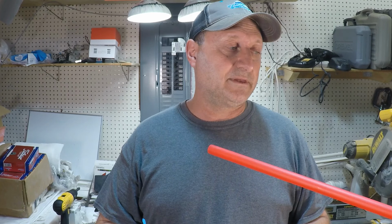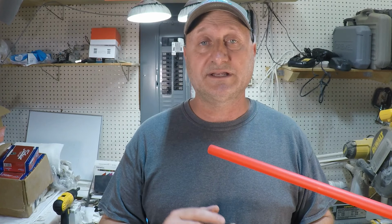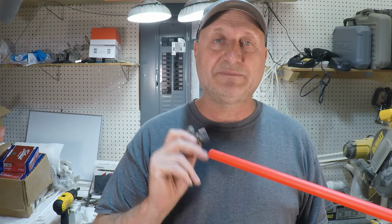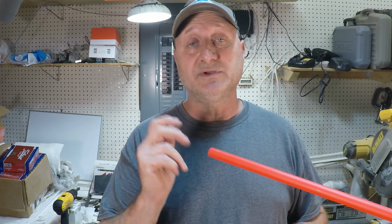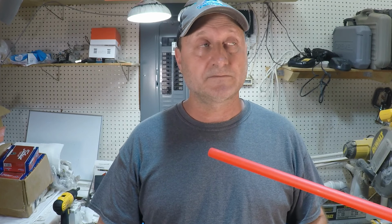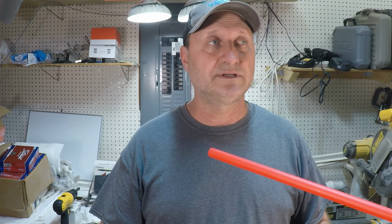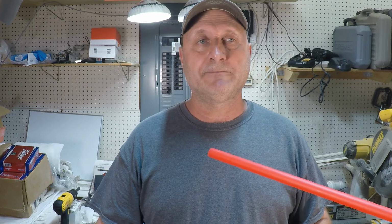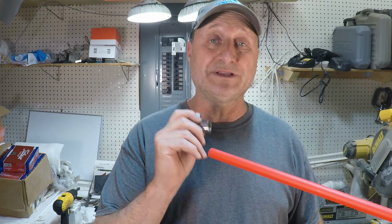So it wasn't noticed that the plumber had used compression fitting without the sleeve on the PEX pipe for this entire project. And then a couple months later, it happened again on the other side of the building. Another one popped off. So we ended up having to hire a different plumber to come in, and I forget how much we spent, maybe $8,000, I don't know. It was only 28 apartments, but to change out all of the valves, to put the ones that use the crimping tool, and make sure that this would never happen again.